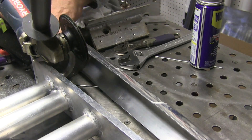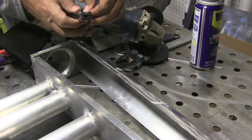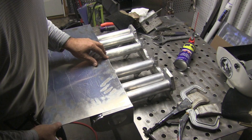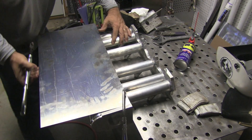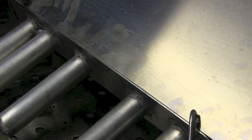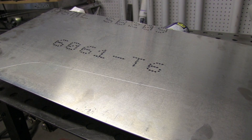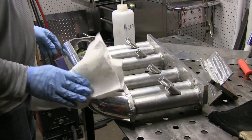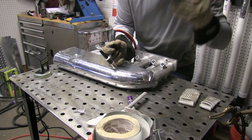First thing I've got to do is sand this thing off, get a nice smooth straight edge here as straight as possible. I'm not going to try to get it perfectly straight because I'm going to scribe a line anyway. Here I'm just deburring using the Leatherman tool, making sure I don't have any burrs on the inside. I'm going to clamp this piece of 063 — that's 1.6 millimeter thick sheet metal — leaving just enough room for a weld, about an eighth of an inch, roughly three millimeters. I'm going to scribe a line with the pocket knife part of the Leatherman. I cut it using a cutting wheel with a four-and-a-half-inch grinder, then cleaned it up with a disk sander. Then giving a good acetone wipe on everything — all the welded surfaces — to get all the tape residue and gunk off.